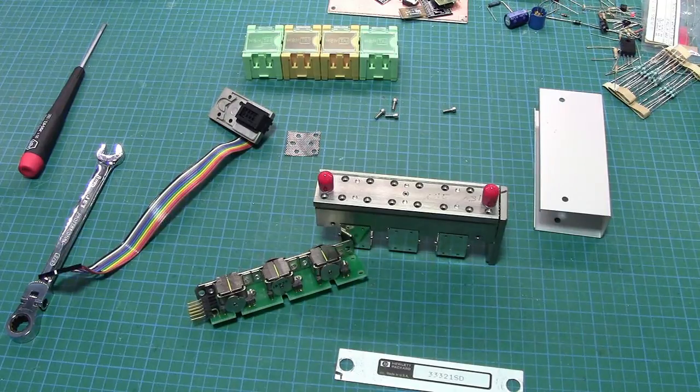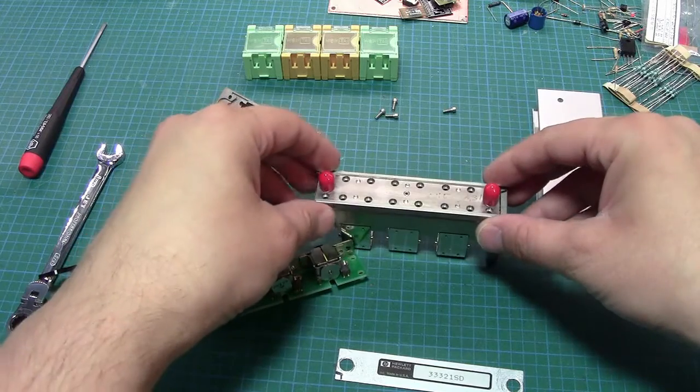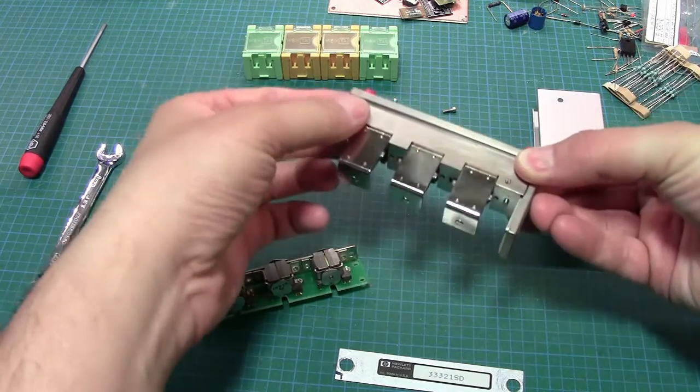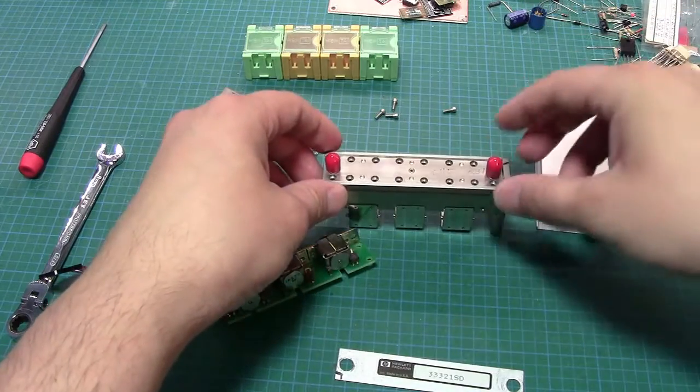All the pads. And of course, I did my final checkout after I put these in, saying, okay, everything's good. Measured the output, and the outputs were wrong, like significantly wrong, and they were going all over the board. I said, wow, what the hell's going on now? Did I break something else? Well, not quite. See, what happened was the insides were the same, right, of those two new attenuators.